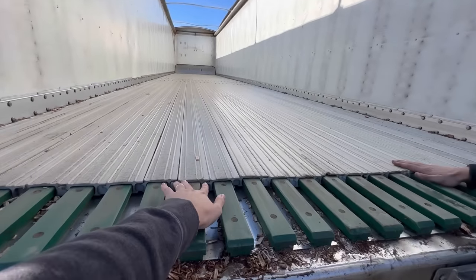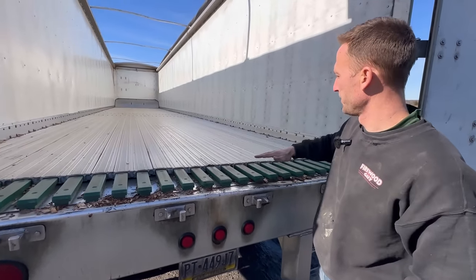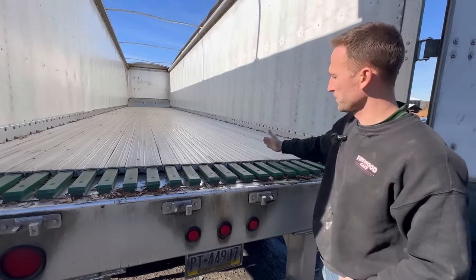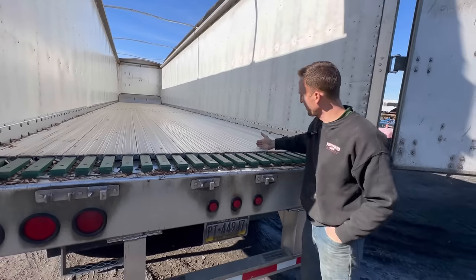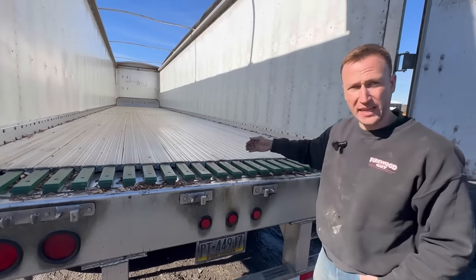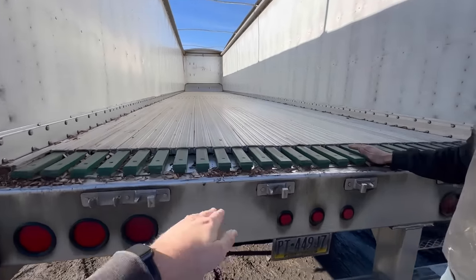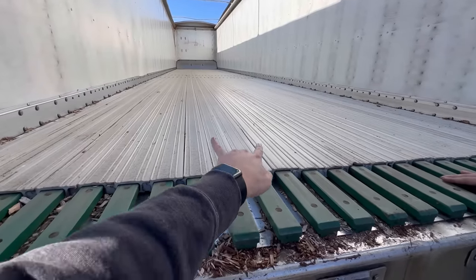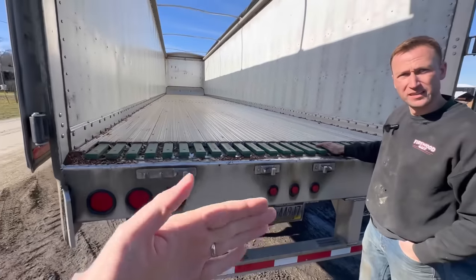They're basically 1x4s, right? And they're all independent of each other. The way it works on walking a load in or out is every third slat is connected to each other. So this row would move back, then this row would move back, then this row would move back, and then they would all move together to move the load in or out. So it slides everything out, and then the friction of two of them holds the load in place while one moves back, and then these two will hold in place while this one moves back. And then once you got all three back, then you're good.